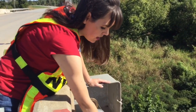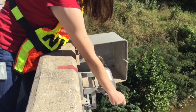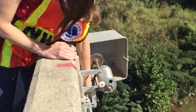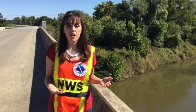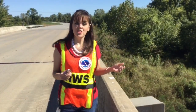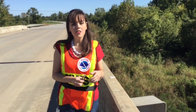As you roll up the weight, you do not need to lift the lever — it will be fine with it hanging down there. Raise the weight all the way back up and make sure you've got it secured, then put the check bar back in place. If you happen to drop the lock or the weight breaks off the wire, please let the Weather Service know so we can call the appropriate people to fix the gauge. Once you're done, close the cover, put the lock back on, and when you get back to your vehicle, call the Weather Service with your reading.